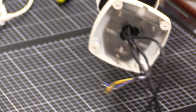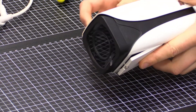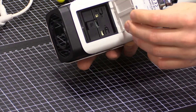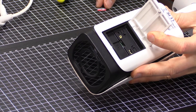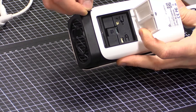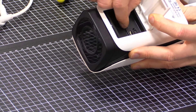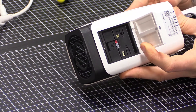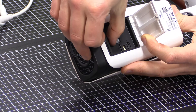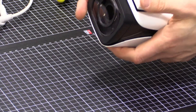Starting with the Ultimate Series bullet — these are probably the easiest to put an SD card in. The only thing you need to do is loosen the screw at the base, flip it open, and you can see the slot in the base. To insert the card, simply line it up with the pictogram and slide it in — the card is inserted. To release it, push back in again and slide the card out.